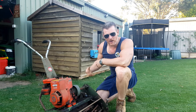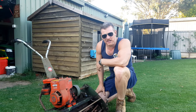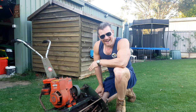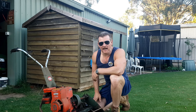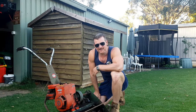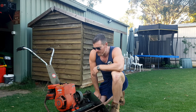I know this engine doesn't run at the moment but I'm confident in my abilities to get it running with minimum fuss. It's got spark, it's got compression, and it's not seized. The last thing will be air and fuel, but we're not going to check that out here because it's likely gummed up with old fuel — we can work that out when we get home. Now if this had been a unit that was running, the last thing to do is ask for a lap around the yard. Take it for a spin, see if it's running and cutting, and see if it's doing all the things you want it to do. The other stuff — thrust pads, deflector nuts, adjusters — is relatively minor.